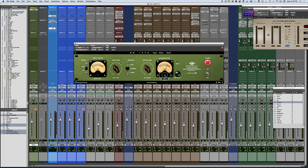And then there's a wet dry mix, which is hidden here on the little adjustment. Actually, that would be like a little screw adjustment, or what they would call a tweaker adjustment to calibrate the meters that would be on that. So you have an output trim on here as well on the left one. Now, this is different because it's sort of a post-processing output trim. So it's meant to compensate if you really want to drive the signal inside of it pretty hard.